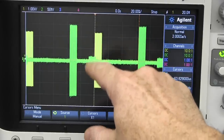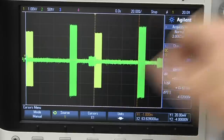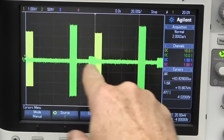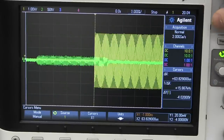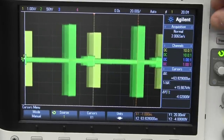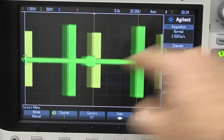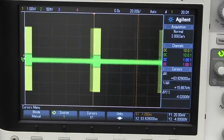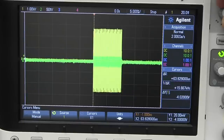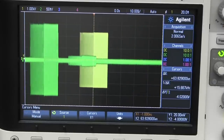One thing you'll notice is that we do have an additional waveform — it looks like we've got some reflected bounce or something happening in here. It's not aligned with our main signal and doesn't seem to be a multiple of it, so it's not like a second reflection. What I'll do is physically remove the delay line from the breadboard and we expect these to vanish. And there we go — we've still got that capacitive coupling even with no delay line in the breadboard at all, so that's just coupling from the breadboard at that frequency.